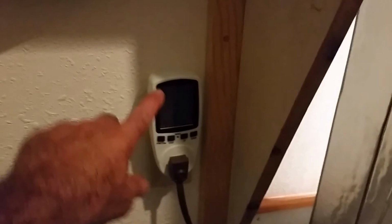This refrigerator, before I modified it, was a little bit over 1 kilowatt-hour in a 24-hour period, and I make all of these determinations using a kilowatt meter. This now, at least in the late summer, I don't know how, it's pretty insulated, this room. I'd say this room probably doesn't get over 80 degrees. At any rate, I had 660 watt hours in a 24-hour period where I was a little over 1K. So $45 worth of insulation really pays off if you're counting watts.